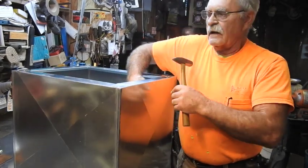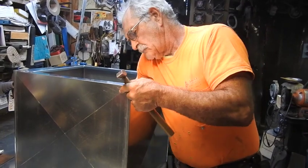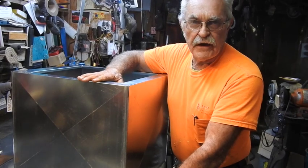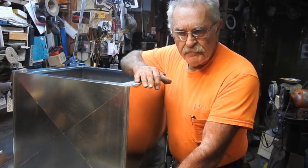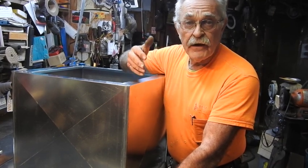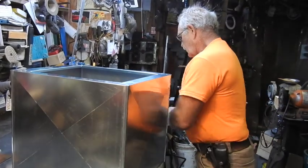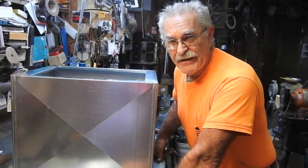That'll make sure your furnace gets a nice flat base to set on. I'll probably put two-inch ArmaFlex tape all the way around the perimeter of this and then set the furnace directly on top to minimize any leakage. However, this is not really a finished area, but it's not like it's in an attic, so any air infiltration from down in and around the laundry area is actually kind of good because it'll help dehumidify that area near the washing machine and dryer. It doesn't really hurt if there's a little bit of leakage, especially on the return side. Most systems suffer for return air anyway, so if you've got a little bit of leakage on the return it actually kind of helps the system.